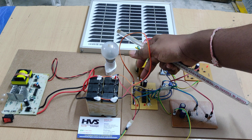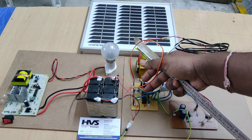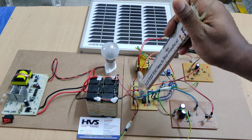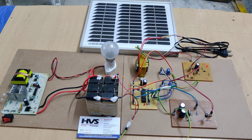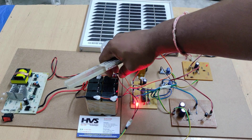The battery output is also given to the motherboard, where a 7805 regulator provides 5 volts to power the microcontroller. There is also a reset switch to restart the microcontroller and a crystal oscillator to provide the clock frequency — the microcontroller executes instructions based on this clock frequency. This is the main on/off switch.